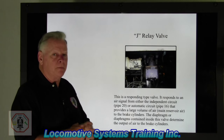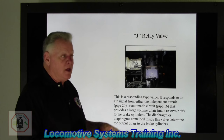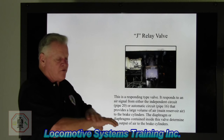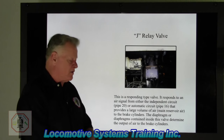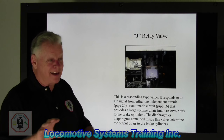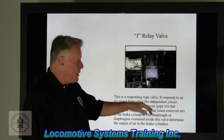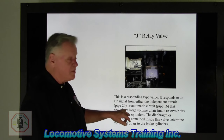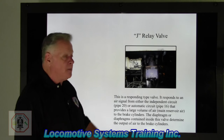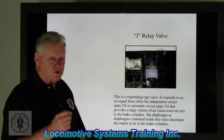And see, a lot of people think that when I move the automatic brake valve handle, a signal from the automatic brake valve handle goes down to all the brake cylinders and fills up all the brake cylinders from the automatic brake valve. Absolutely wrong, not true, completely incorrect, wrong answer. This guy responds to either a pipe 20 air signal, which would be the independent circuit, or pipe 16, which is the automatic circuit,